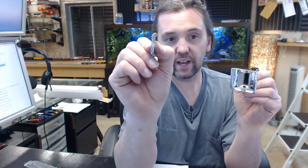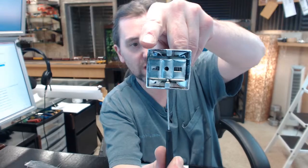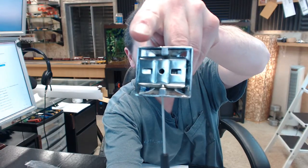At that point, those angles will be turned out from the face of the wall. You will be able to rest your bracket on the inside shoulder and it will stay in position long enough to come in with your screwdriver again and tighten up that set screw. It is a concealed mount — you can see that as I tighten it up how that works. Then at that point it is solid on the wall.